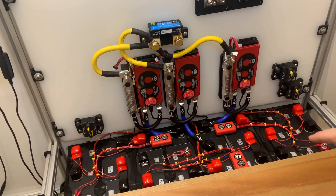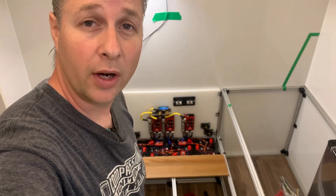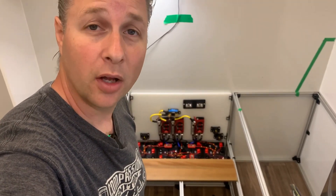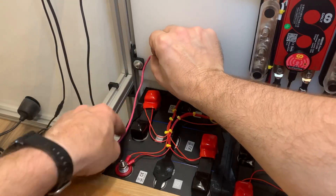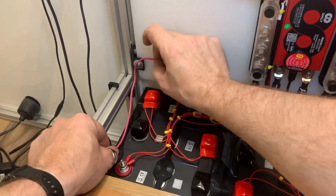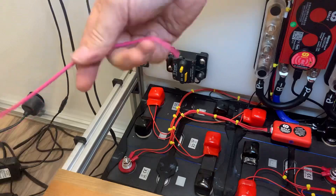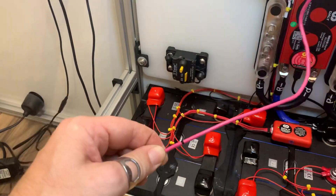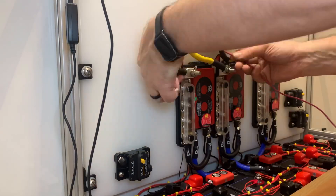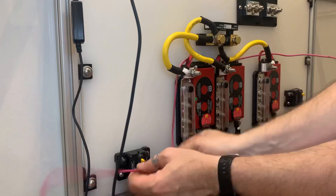In the design I did I didn't actually have the final placement of the shunt, and that means when it comes to running the positive cables from the power post to the breaker and up to the positive bus bar I don't have my final lengths already determined. But I'm going to show you a trick to make sure all your wires come out the same length even if you don't have the ability to draw things up in CAD first. I'm using a scrap piece of smaller gauge wire to trace the path that the larger gauge wire will take. This wire is somewhat stiff so I can form a nice radius to simulate what the heavy cable will do. Once I like the way it looks I put a mark on the wire and then continue from that mark to measure the next section, measuring out the whole path as one wire to get the total run length. The best part is this in no way uses up the wire, so I still have it for when I need it later.